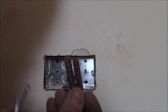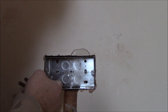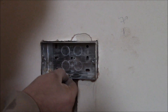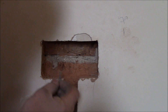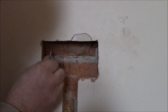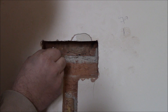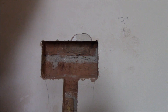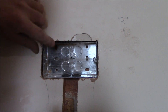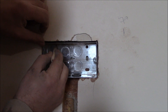I need two rubber grommets just so the cable doesn't touch the metal box. Now I'm going to fit two wall plugs and two screws in any of these holes made at the back of the back box. When you drill the holes, as you see, this is the cement and this is the bricks — so it's better to drill and fit the plug through the bricks than the cement. So I'm going to mark it first — one is going to be here, one is going to be here.